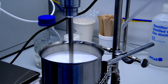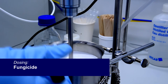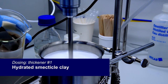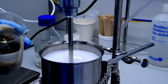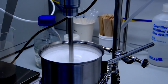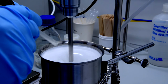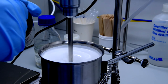Next, a fungicide to protect the coating from mold. And thickeners — first, a mineral thickener: hydrated smectite clay to improve rheological properties in the area of low and medium shear forces and give body to our paint. And a second thickener: an ICI builder that improves rheological properties in the area of high shear forces for easier application with a brush, roller, and spray.